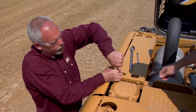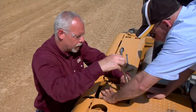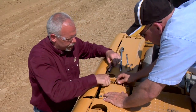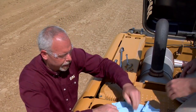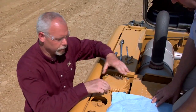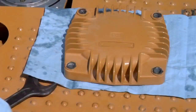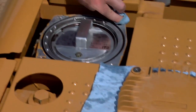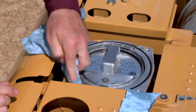I have Scott assisting me here today. We've got the bolts out and we're going to take this cap off. We don't want to just lay the cap down on dirt or anything like that because this is a clean compartment in here. So we'll take this cap off and set it down. At this point, if there's any dirt around the edges, we want to make sure we brush that to the outside edge so it doesn't go down in the filter.